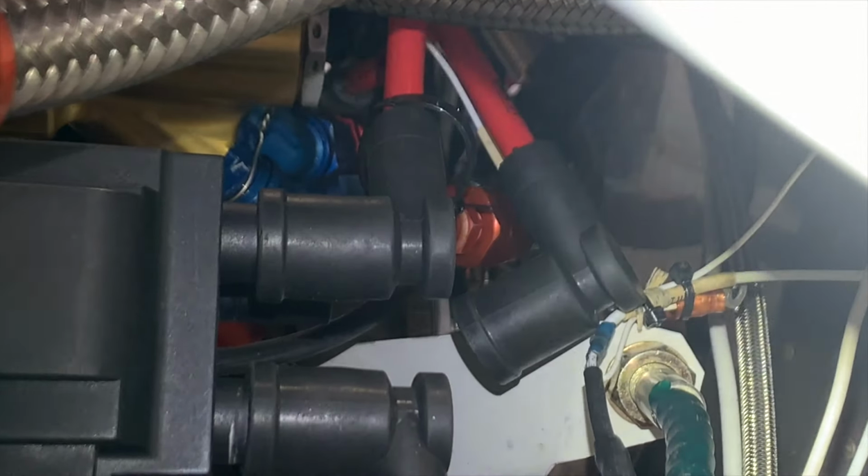So he did tell us that the P-mag leads once in a while would come loose, and sure enough, we pulled the cowling and one of the cylinders on the left P-mag, the wire is hanging free. So we're going to replace those. When we took a look at them, they're just worn out for some reason. Further investigation revealed some interesting things.